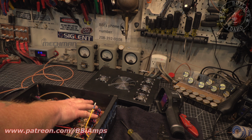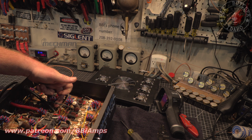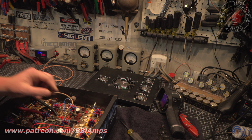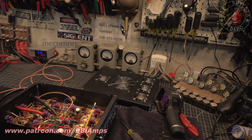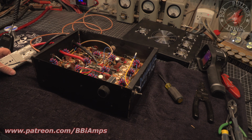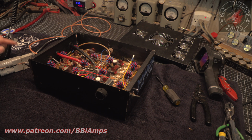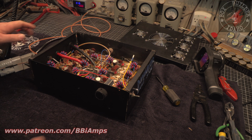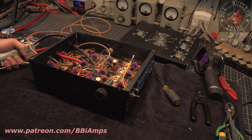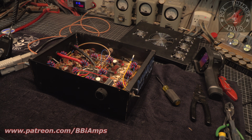Man, this thing is warm. It's starving to death because of our crossover bar. This is too small. This is a solid piece of Romex. We'll fix that. And these cables, this piece of 4-aught, no way it's carrying enough current into these amps. This 175 amp Anderson clip, no way is this carrying enough current. This little Anderson clip is getting hot. It's a giant resistor on your positive and your negative going to this amp.